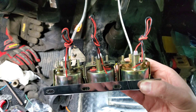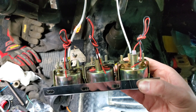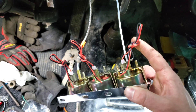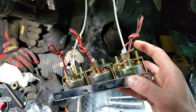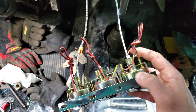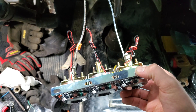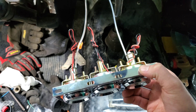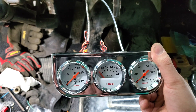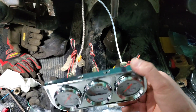As far as the wiring goes, I just make it easy on myself. I run red to red on all of these, and black to black on all of these, so that way all of them are powered on at the same time — these are just the lights. For your voltmeter, as long as it's switched on whenever the vehicle is on, that will be good enough. Make sure you have really good grounds.